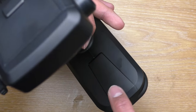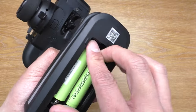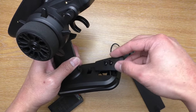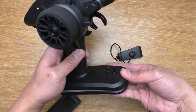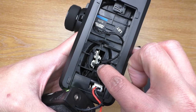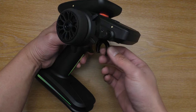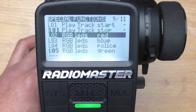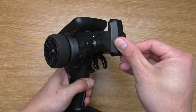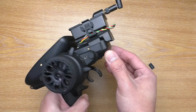There is an expansion slot at the base where you can install extra switches or a joystick. Just remove the battery tray, pull the cover out, install the expansion module, and plug it from the inside. It can control up to 2 inputs; the joystick only takes 2 axes and not the button. There's also RGB lighting — surprisingly, it is not a useless gimmick because you can program it to do anything, for example show the battery level with colors. It also has a foldable antenna at the front that you can turn up for better reception, though unfortunately you cannot turn the antenna up when the module tray is on.